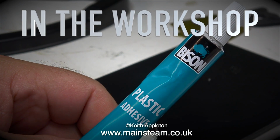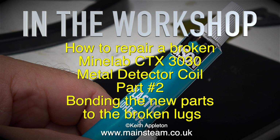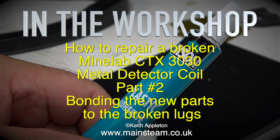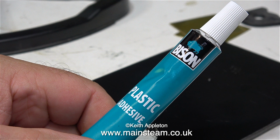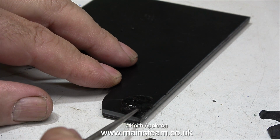In the workshop, how to repair a broken Minelab CTX 3030 metal detector coil. This is part 2, bonding the new parts to the broken lugs. The original lugs were made of ABS, as indeed is the rest of the coil case, and I need to bond my parts to this old ABS using some special adhesive. This is called Bison, and this stuff turned out to be perfect for the job that I want it for.